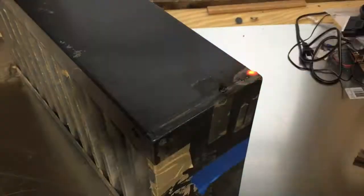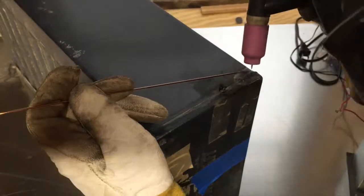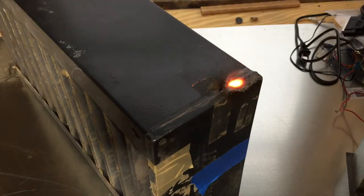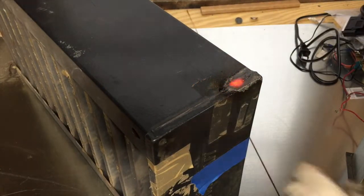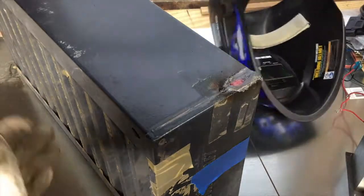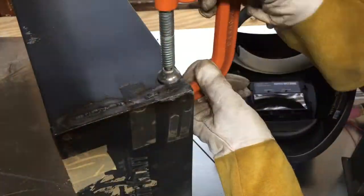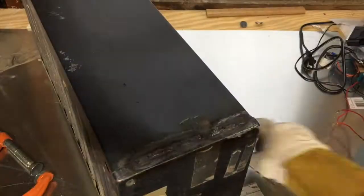At some point I saw that the sheet metal was warping and separating from the lap joint I was working on, so I clamped it together with a C-clamp. I had to clamp it and then move the clamp a little bit at a time and clamp it more. It turned out okay — not the best welding job I've done, but it will do just fine.